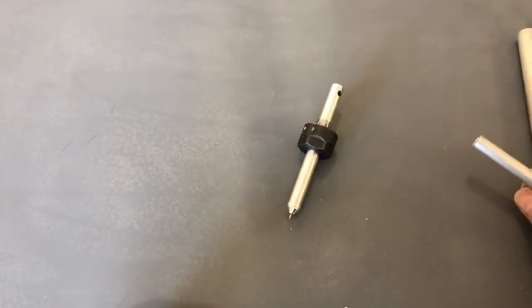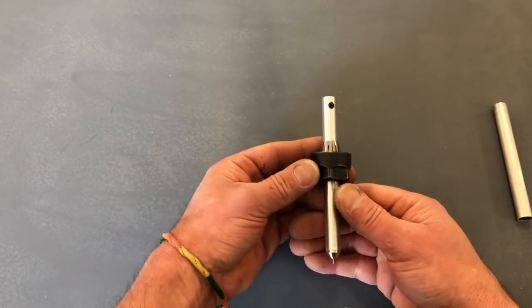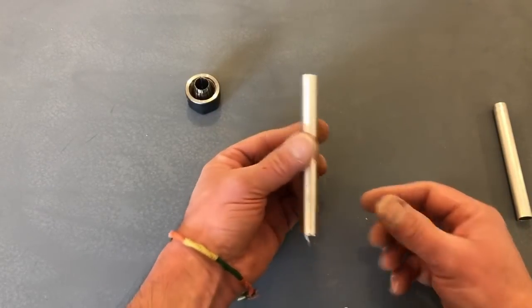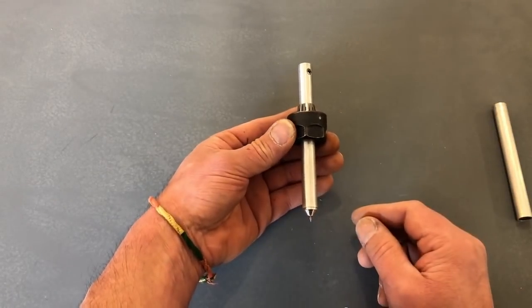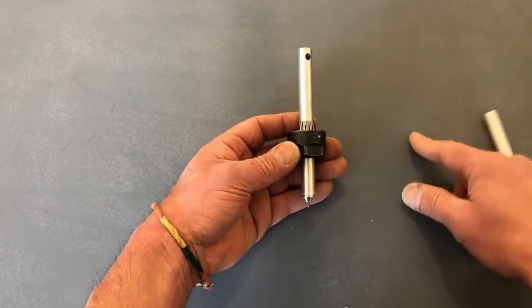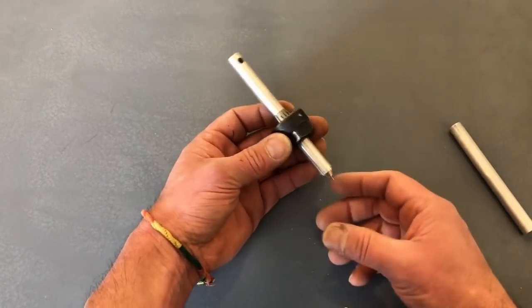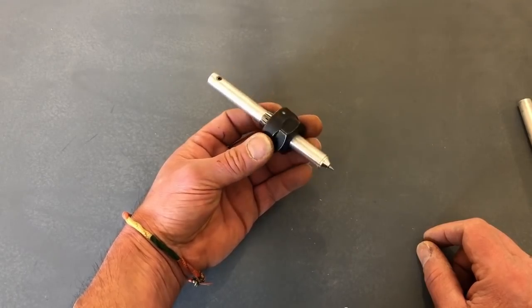Now the final one is pretty darn cool. You can actually buy these attachments — they're actually a couple hundred bucks. I'm sure theirs is actually better, but this was very cheap to build. I basically made a pen. The beauty of this is that it fits in my half-inch collet, so this is truly centered up on the router, which is an important feature — especially if you are going to be doing a combination of work, like cutting out patterned parts and marking them at the same time. You can chuck this in there and run it.